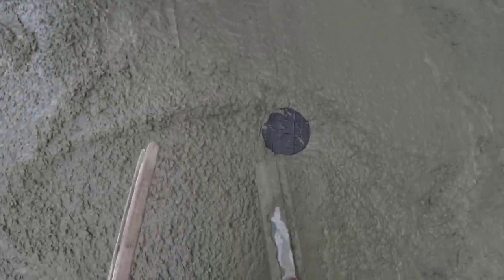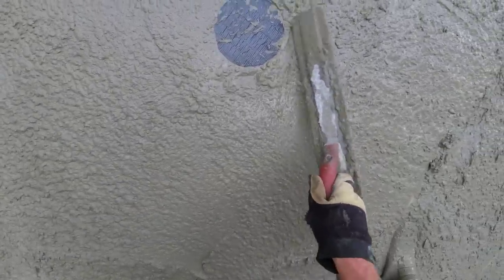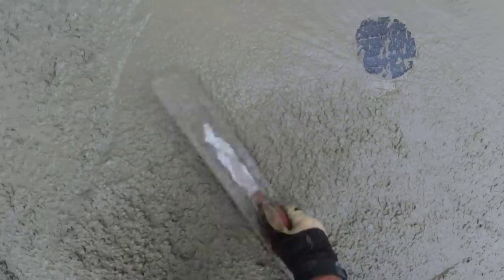This little round black thing right here is a floor drain. This little part of the house is a garage, so we slope part of this floor to the floor drain, and then when he drives a car in and parks it and anything drips off the car, it's going to go to the drain. It slopes about an inch from the outside walls.